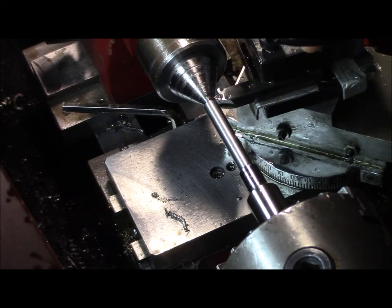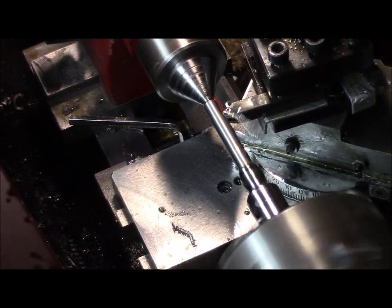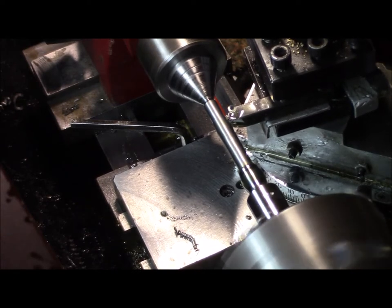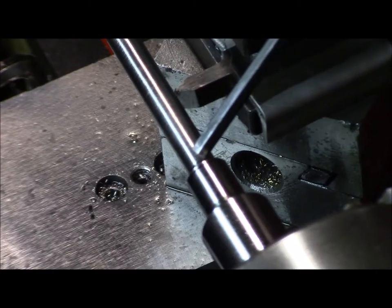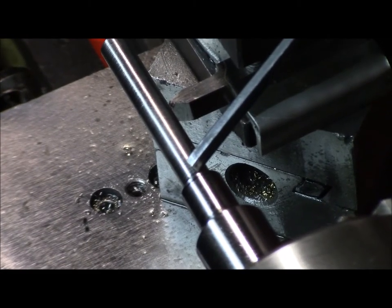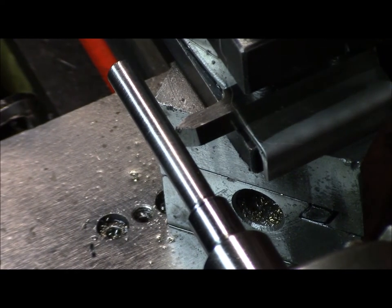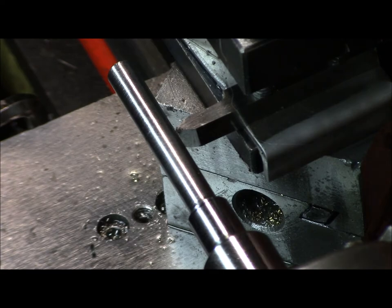That is 0.275; the last pass should bring it to 0.250. The screw itself is about 0.246 and it's reading 0.251-0.252. This part right here is an 82-degree angle that simulates the countersink on the head of the screw. I've changed the gears out already and I'm setting up to cut three-quarters of an inch worth of 1/4-28 threads — just finding my stopping point.